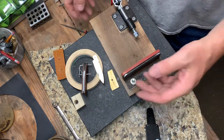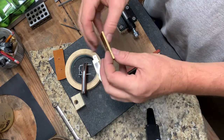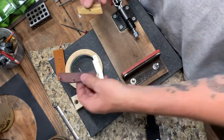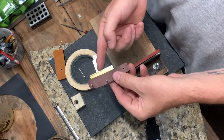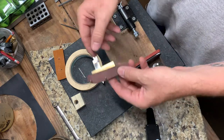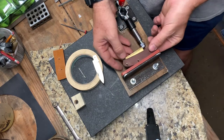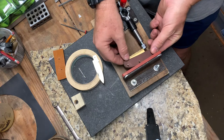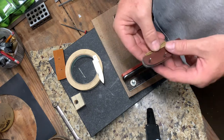This knife hasn't been finished yet, but you still don't want to dent it or scratch it, especially when you get to the point where you're putting together a basically finished knife. I've got a little piece of brass that I've milled — it's kind of a T, and it's a wedge shape so that when you get it into the knife, you've got a level area to press against. I've looked at how much space I have and how much I think I need to compress the spring, and that's where I've adjusted this ram. The ram's already adjusted.